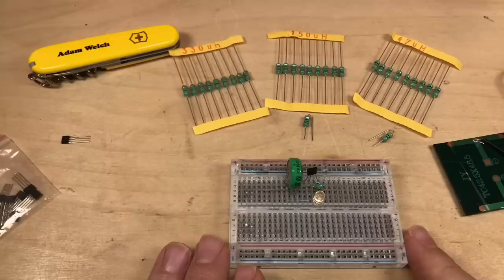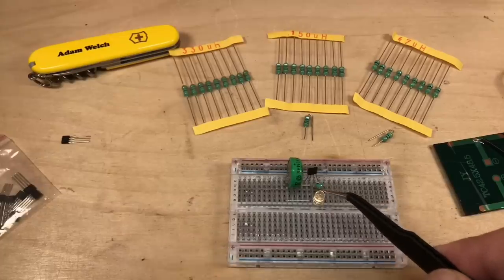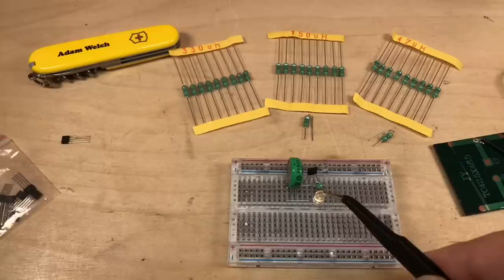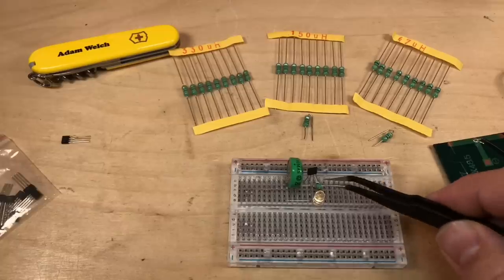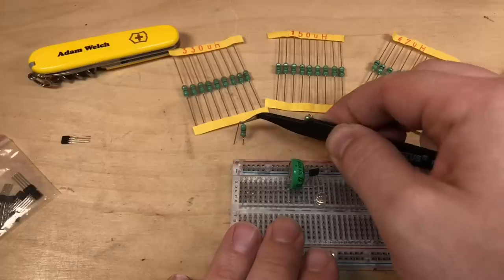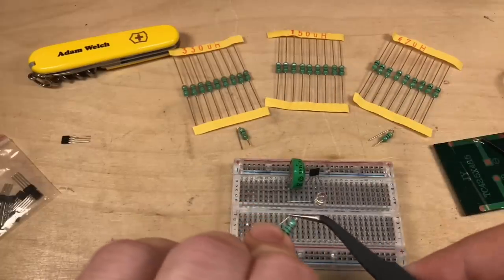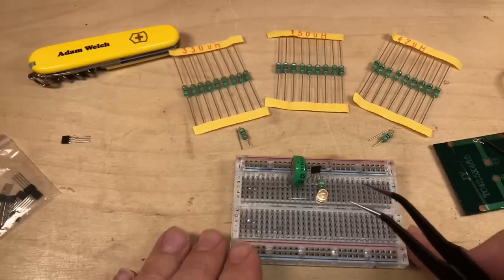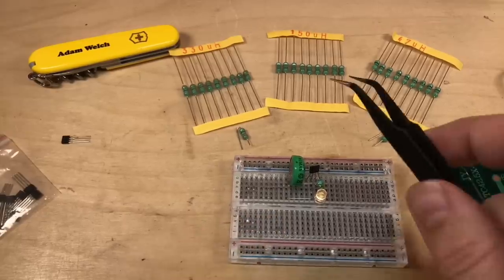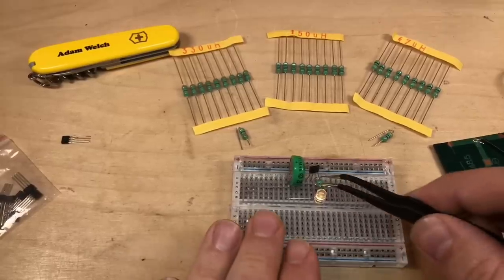Well, yes, that's definitely lighting the LED. So I'm boosting the 1.2 volts up to 3 volts or beyond to get that white LED illuminated. But it's a bit dim, isn't it? It's not great, that. I have put the camera on a fixed exposure, so hopefully you will be able to see what's going on. Between 2 and 4 again. Yeah, I think that's a bit brighter, isn't it? So the 150 is definitely, yeah, I'm sure that is definitely brighter.